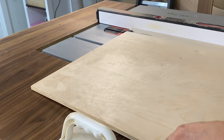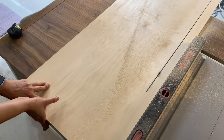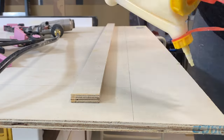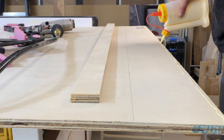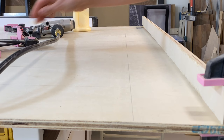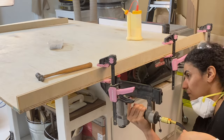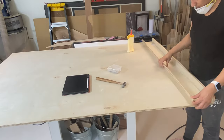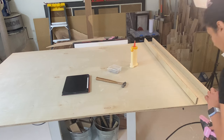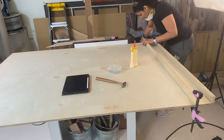The top was pretty simple to build. I built it focusing on the size of the gaming board mat my husband will place inside — I'll leave a link to that mat in the description. In real life I actually started building the table from this section. For the walls I only used glue and a nailer; I was planning on adding screws but after leaving it to dry overnight the glue was enough, and since it was half-inch plywood I didn't want to risk splitting it. I probably should have added the outer walls first and then the inner walls, but that's what happens when you don't plan well.